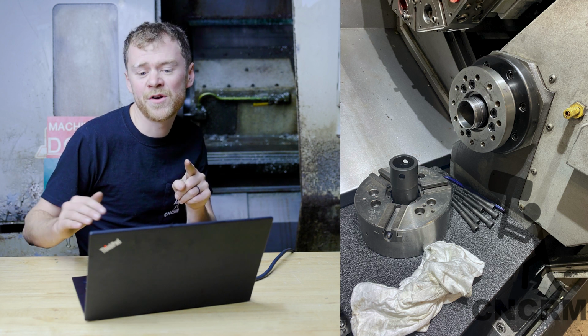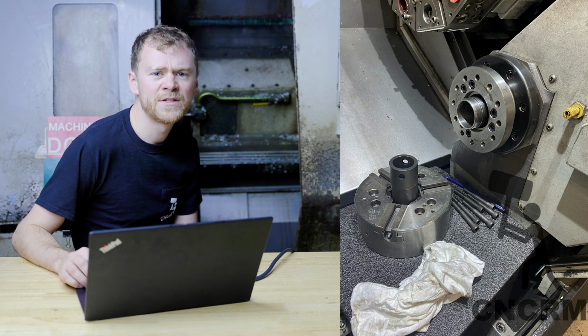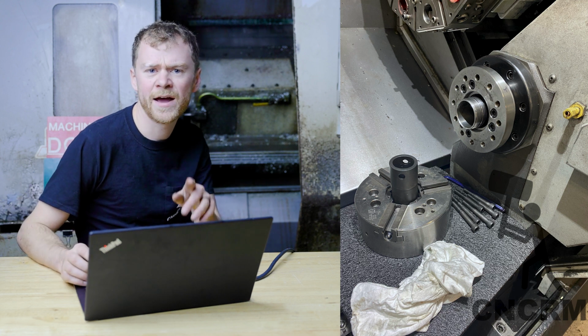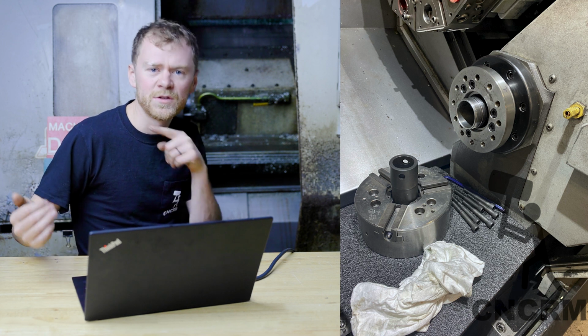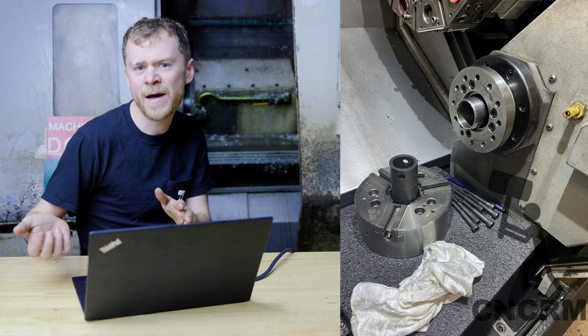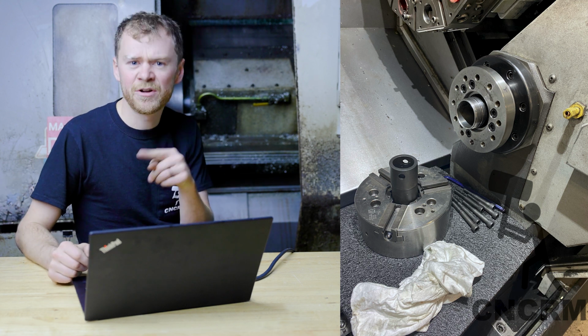And if you have that parameter turned off to just jog Y, you can jog the two of them, and then you need to go reset the home position for X, and you need to reset the tool change position for X, and the same one for Y. Then zero return Y, turn on the parameter, zero return X, turn on the parameter, cycle the power on the machine, and then come back down to your center line position and dial in and check that you're good.